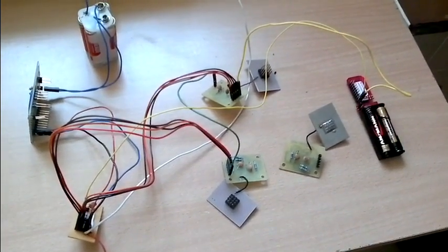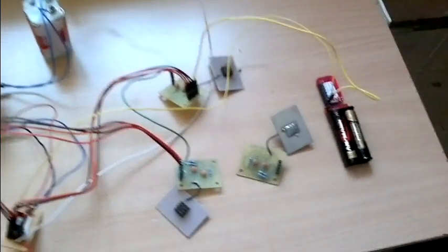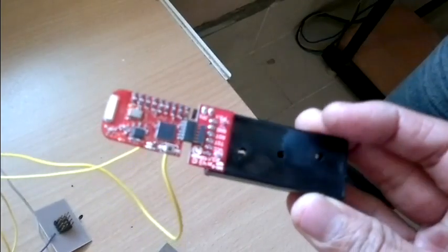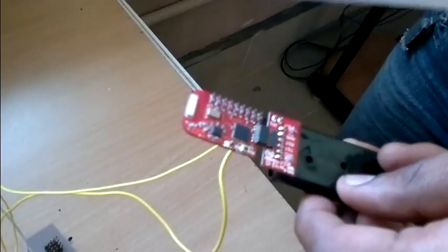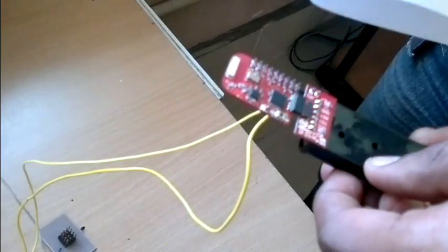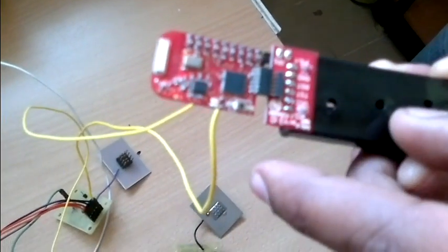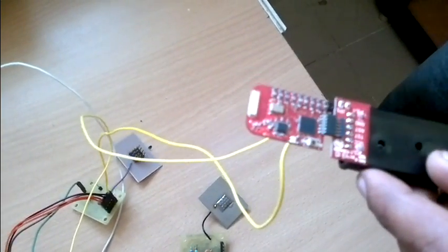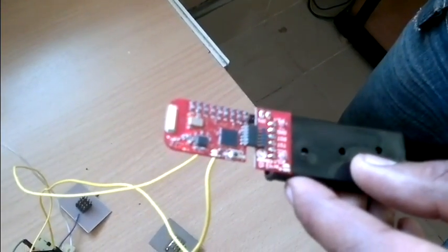The signal amplified by the active electrodes is then sent to the MSP430 microcontroller. The SAR ADC which is built into the microcontroller is used to digitize the analog signal amplified from the active electrode. This is the EZ430 RF2500 module from Texas Instruments. It has an MSP430 16-bit microcontroller and a wireless transmitter chip CC2500, which transmits the signal in the 2.4 GHz ISM band within 20 to 30 meters from the device.